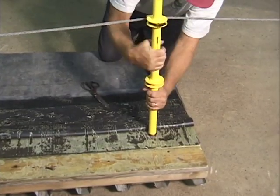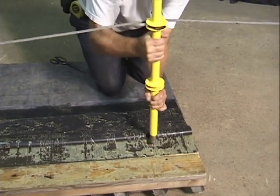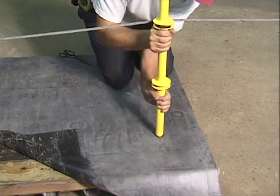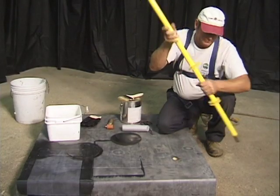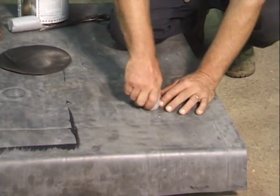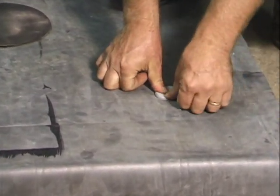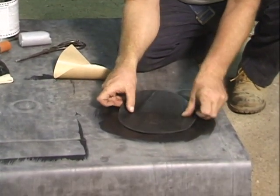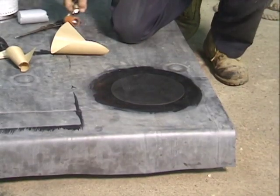With our system, you simply make a small opening, back out the post while leaving the cable in place, and run the roofing underneath it. When perimeter protection is no longer needed, you just cover that small opening with a patch. There's no cutting or grinding, just peel and stick, and the job is finished.